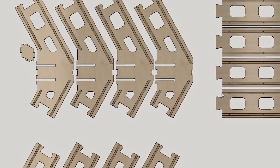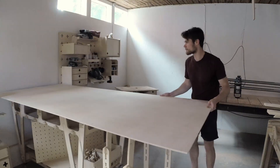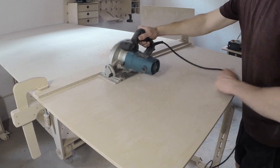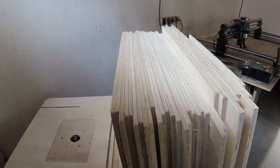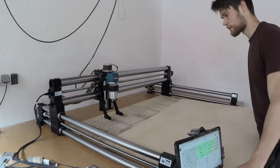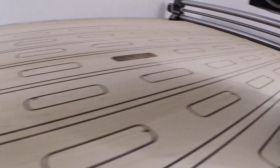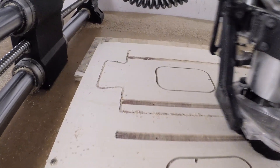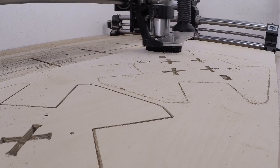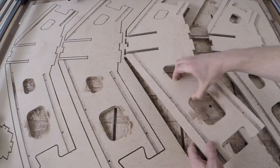The design was ready for CNC operations, but before turning 11 sheets into components I had to slice them into smaller sheets that could fit on our CNC's work surface and optimize the part layout for the most efficient cutting. I created seven different programs to cut the parts — it was just a matter of loading the sheets on the CNC and removing parts from the work surface after the cuts were done. First I cut the frame reinforcements and corner parts, then the side components and corner reinforcements.